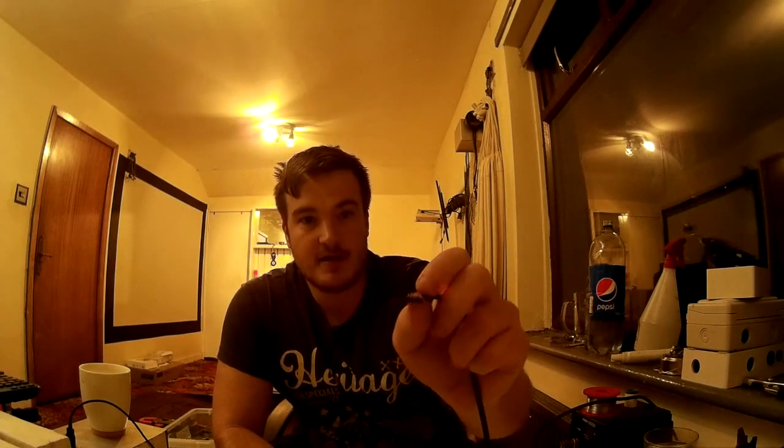Now, what other measurements could you do with this? We took the resistance of the digital pins into account. So you can't measure an EC over 3 with it because your digital pins just can't supply that much current. But you could measure by changing the resistor here. You could use it to measure the quality of drinking water as well by increasing the resistance.